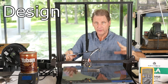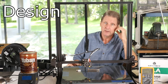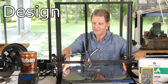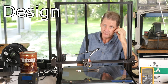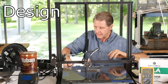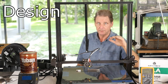For clamping: they come with six little clamps and I over-clamped - two in front, two in back. Then it occurred to me: three points define a plane. After that I went to three clamps and felt where it's solid. I now use two clamps in front and one in back, and that improved things. The trick there: don't flip the glass over - I think it's not the glass that's bowed, but the clamps arcing the glass. Even a few thousandths matters when setting that critical first layer.